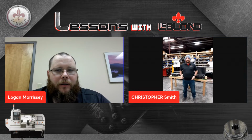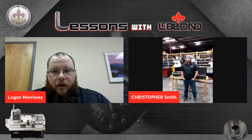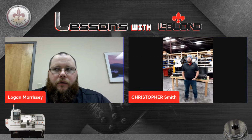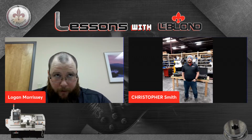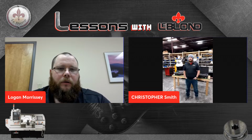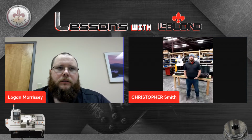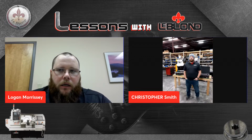I'm going to start out today by discussing our bandsaws. We have a horizontal and a vertical. Both feature a 2 horsepower motor. The horizontal is the LHS-10. That has a cutting capacity at 90 degrees of 9.8 inches, and at 45 degrees, it's 7.5. The blade speed on the LHS-10 is 82 to 259 feet per minute.